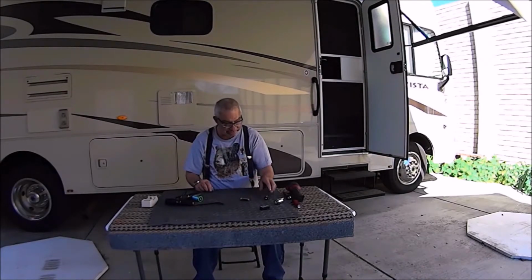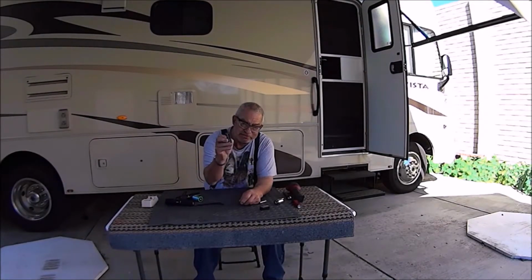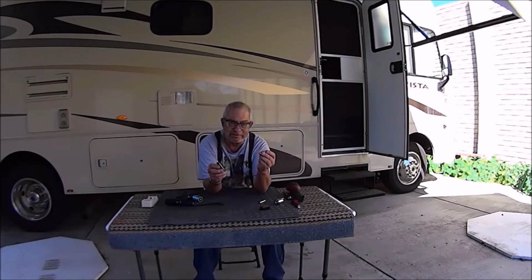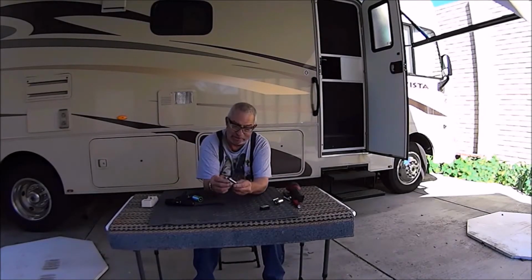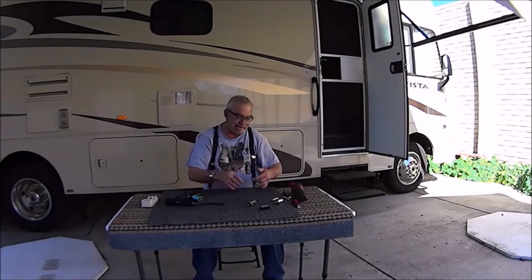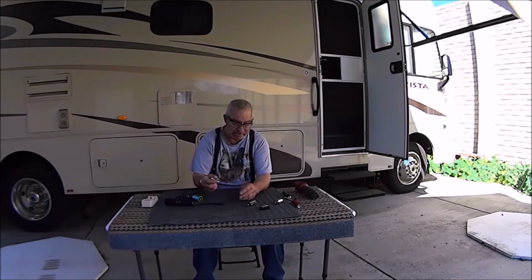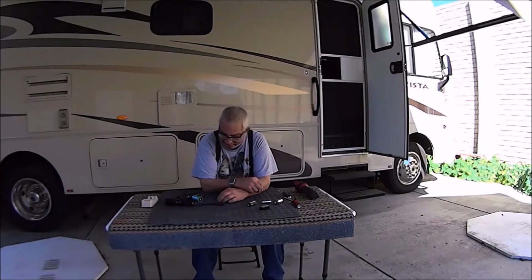Now, whenever you go to put it into a device, whatever it is, even our little 3-pack right here, you notice the spring? The spring, too, is always negative. So, that's your ground. So you take the right size battery, and you put that in there. And what I like to do whenever I put a battery in, just to make sure I get good contact, I just roll it. How many times have you put some batteries in a flashlight, you turn it on and it comes on either dim or not on, so you got to take them out, you got to roll it around, you got to bang it a few times, and that's a bad connection. One thing I like to carry is a Scotch-Brite pad, and I got one in the RV, and so if they're giving you some crap, just shine it a little bit, a couple strokes, throw it in there, and there you go.